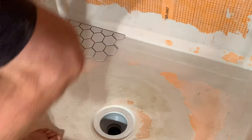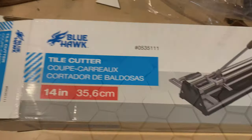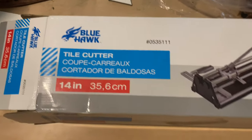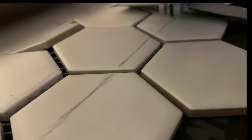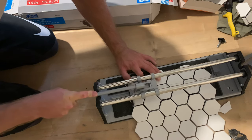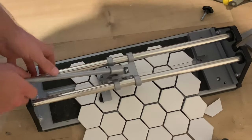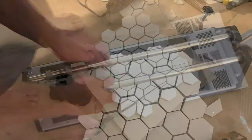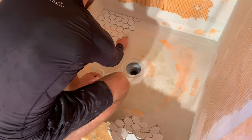Step one in this project is to get a proper dry fit in the shower pan. With most mosaic tiles, you're going to need to cut at least one side so it's flat along the intersection between the pan and the wall. I really recommend you use a dry tile cutter — I'll leave a link in the description for the one I used. Make your mark along your mosaic tiles and then position it within the tile cutter. The cutter wheel will be pushed along your line to score the face of the tile, and then you'll apply pressure to break the tiles along the line you previously scribed. Then grab some scissors or snippers and cut off the mosaic mesh, and you're left with a nice flat line along the wall.